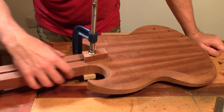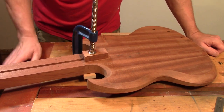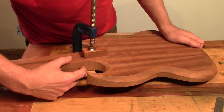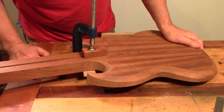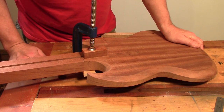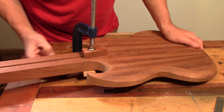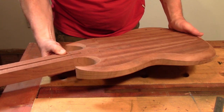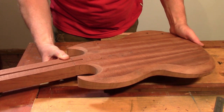I've been backwards and forwards with this neck joint now for a little while. I've got it all cleaned up and fitting pretty nice. There's no gap at all where it meets the body, which is great. It might need a little bit of tweaking once I've got the rest of the neck shaped, but we'll see how that goes. The neck joint is nice and tight but not so tight that it's going to squeeze all the glue out when you put it together, which is really what you're aiming for.